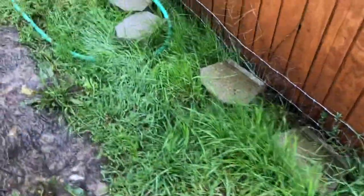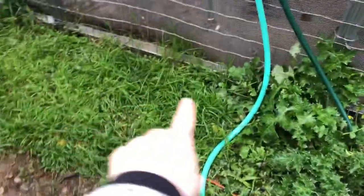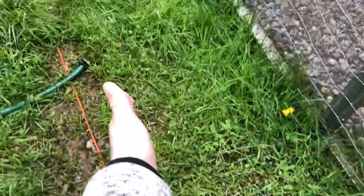We did that so that nothing could lift that skirting up and crawl underneath it or dig or whatever it may be. Now, we didn't put the stone pavers on this side or the other side over there because there are very large metal poles that have rebars, and this ground's super, super duper hard, and the skirting goes out about 2.5 to 3 feet.